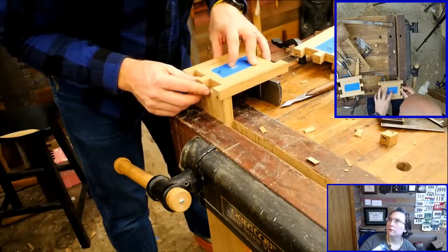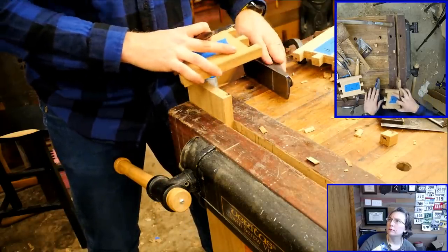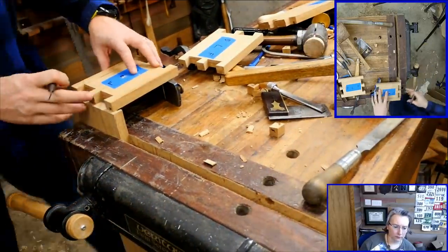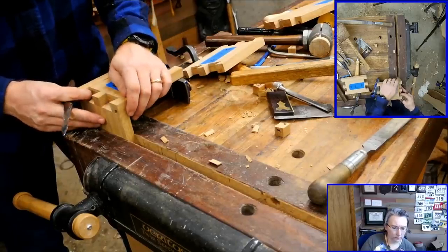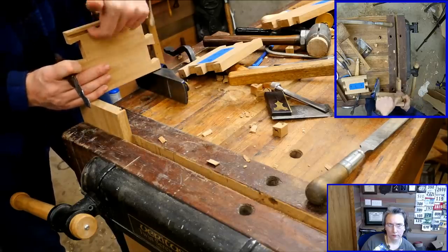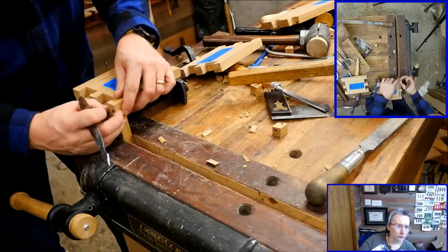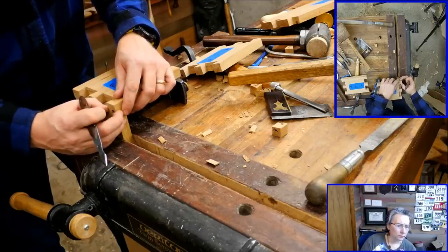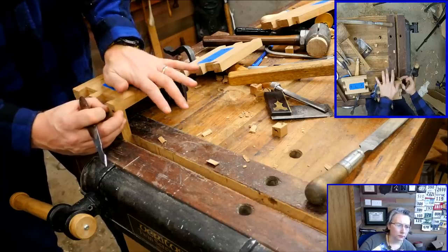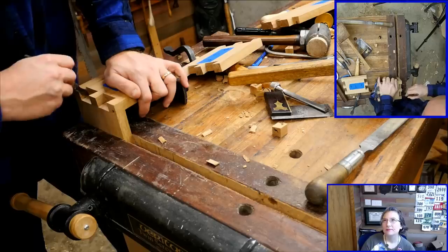Oh, got some junk in there. Must have clamped it down. Oh, well. And this allows me to put the block plane back here a little ways. Move this over a little bit better for you. There you go. And this is really useful for longer boards, as you can put the block plane back as far as you need to. And I'm going to eyeball this up down. Because this is the bottom of the board with the groove, I'm going to make sure that the bottom of this one lines up with the bottom of this one nice and flat there. And then I'm going to eyeball down so that I'm just touching inside. Take my time on this. Once the board gets right where I want it to be, I put all my force down on the board, kind of get down on top of it, and then mark out where these lines are.